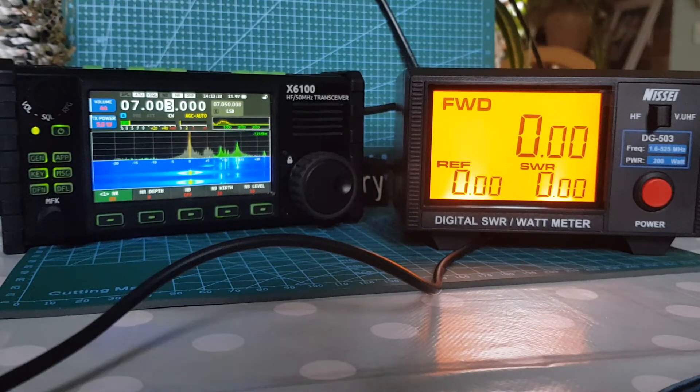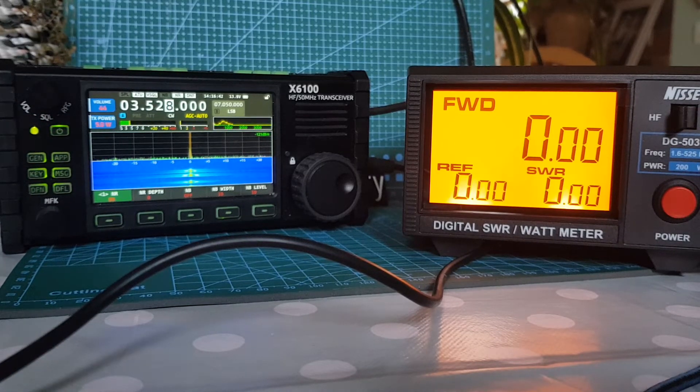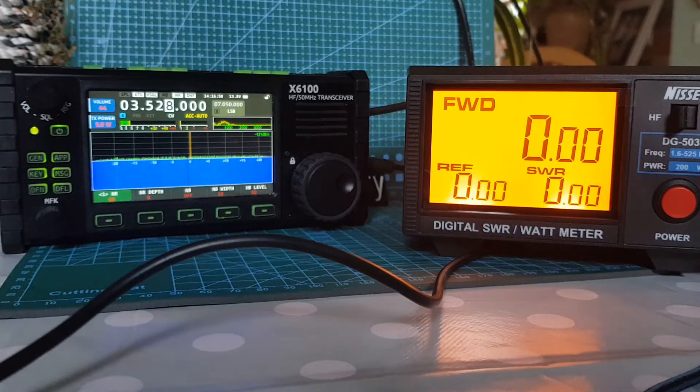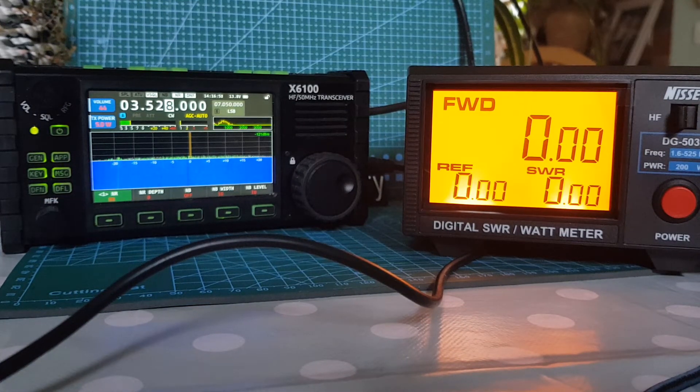So it's only giving out about three watts of power on 40 meters when I'm doing CW. I just think the power is only about three watts — maybe I'm wrong, maybe I'm doing something wrong. But I've got the power and SWR meters all correctly connected. Maybe I should try it with a dummy load — I do have a dummy load. Let's try that.